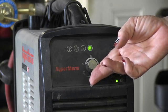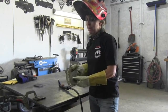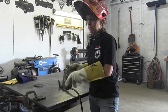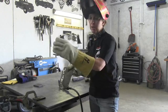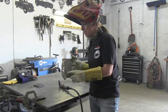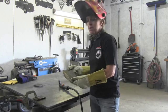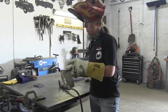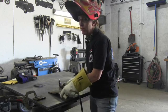Now we go to 20. And this is our victim — a piece of sheet metal with some spot welds that came from our early 50s Chevy that's out kind of decaying in the field. We're just going to see how well our machine settings are going to take care of these spot welds. We'll try it out on one spot weld first and see if those settings are correct.